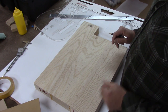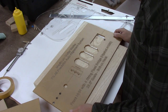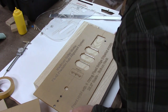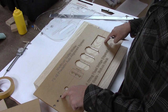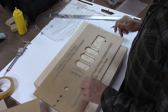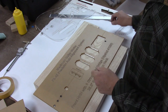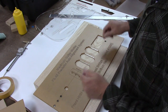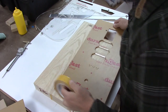Okay, so we're going to use Steve's off-body alignment pins. We're going to use this one and this one. So we're going to line this up. And we need to drill through these steel drill bushings so that we can put these quarter-inch pins into the template or templates, okay? Templates. So remember when I said you wouldn't have to use double stick tape? We're actually going to use a little bit of double stick tape just to get the holes drilled on properly.